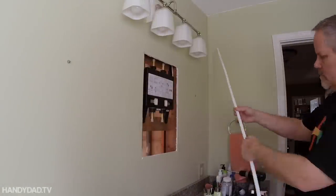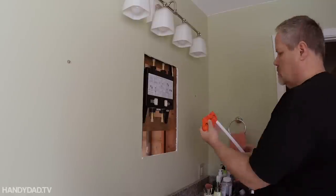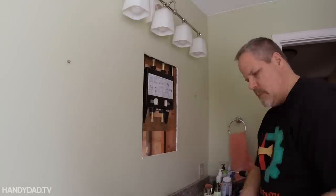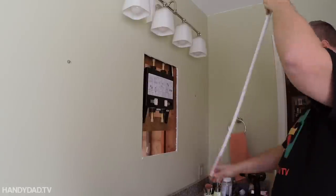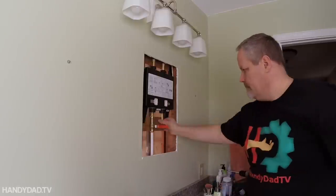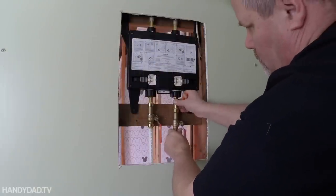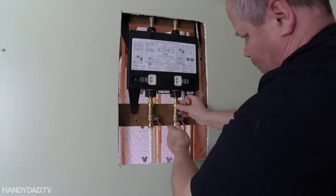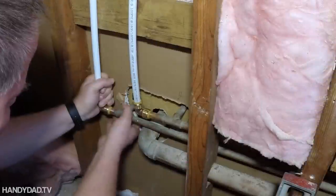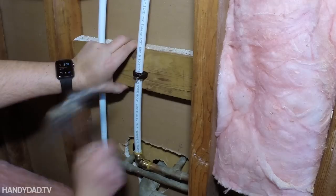This was my first time working with PEX pipe but it was really easy. I cut it with just a snip, take the burrs off the end, and put the valves right on — they slide in perfectly. It's a great solution especially for this valve. The shutoffs were great, and with elbows on the other side it's easy to adapt PEX to copper with no soldering at all.